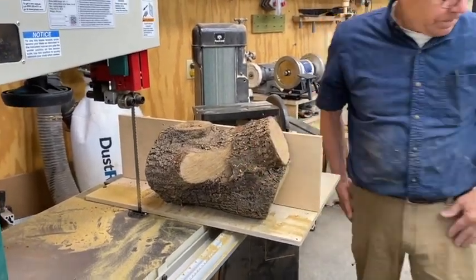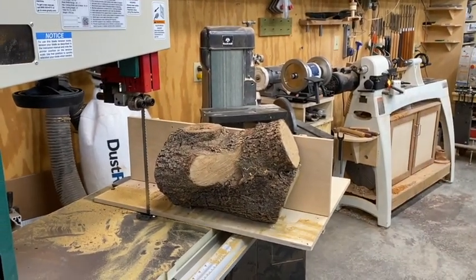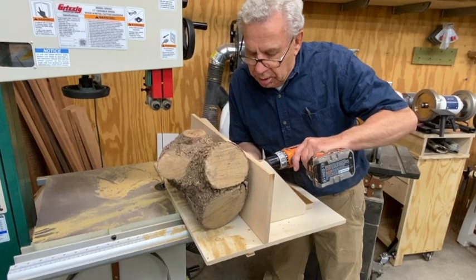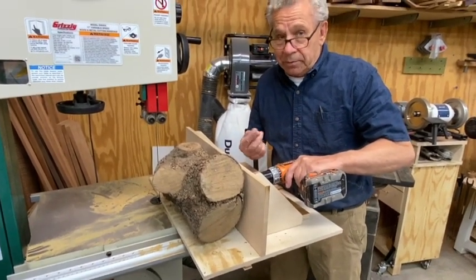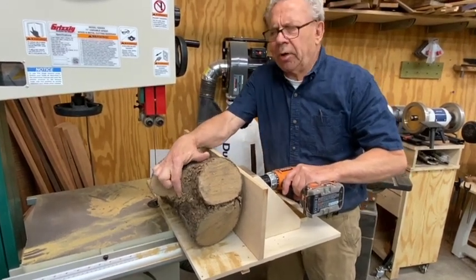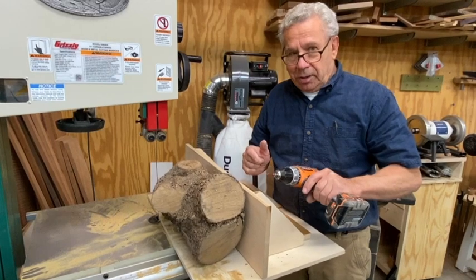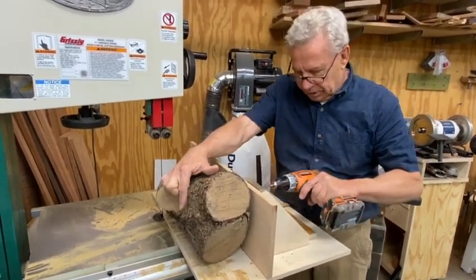So that's a pear wood crotch piece that's going to have some nice feather in it somewhere. Now, when in doubt about which hole to use, use the next one up for leverage to keep it from jacking around. On the one in Wood Magazine, these were slots instead of holes, which I decidedly didn't like. The slot just invites the screw to yank and move in the slot.